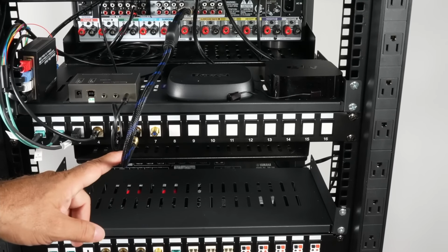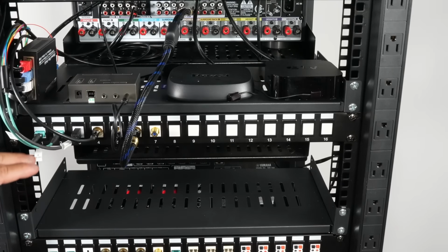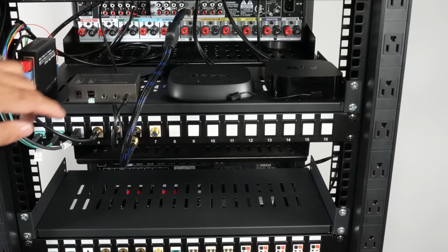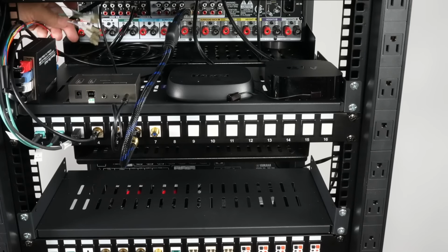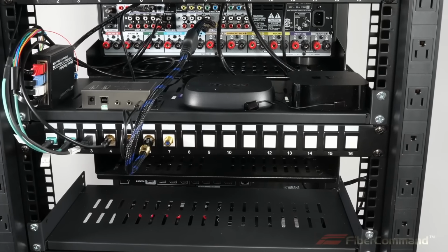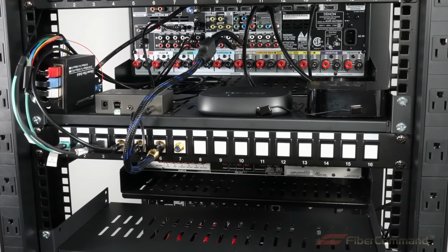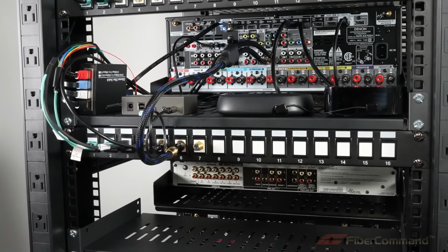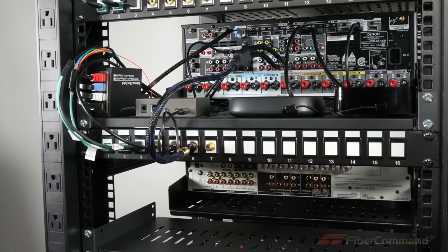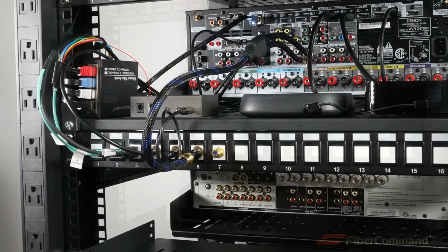Connect the subwoofer or soundbar feed to the room, the smart home music feed from the room, the 4K 8K HDMI feed to the room, and still have 11 spare fibers to add another 3 HDMIs, DisplayPorts, USBs, or other expansions to that room. Each room has its own simple and clean setup, with limitless expandability through adding devices to the zone. You can also use a simple HDMI splitter to share one HDMI source across multiple zones or rooms to play synchronized music through the whole house, or a sport event on every TV in the house.